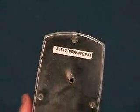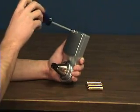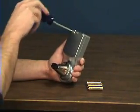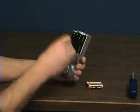Before installing the lock, make sure to write down the serial number, as you'll need this to generate remote codes. To install batteries, remove the cover plate on the back side of the lock. The ResortLock takes 4 AA batteries that should last for about a year.